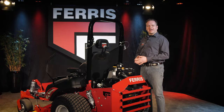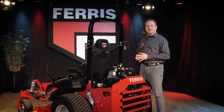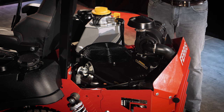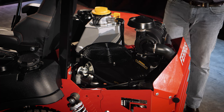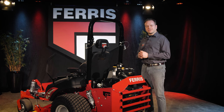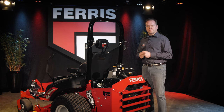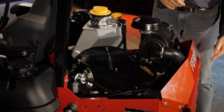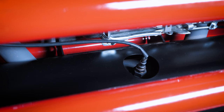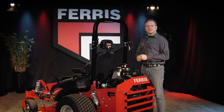The engine at the back of this machine is a 37 horsepower Vanguard gasoline engine featuring a fuel injection system. The electronic fuel injection system delivers fuel under pressure, which results in more efficient fuel evaporation in the combustion chambers, which makes the fuel burn better. The electronic control module of the engine gets continuous feedback from the O2 sensor that is located in the exhaust itself. It ensures that the right fuel and air mixture is delivered to the combustion chambers.